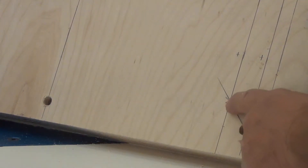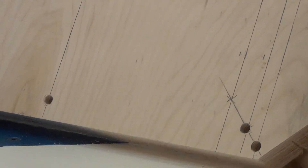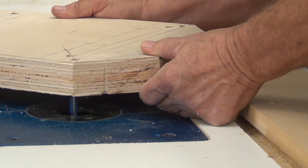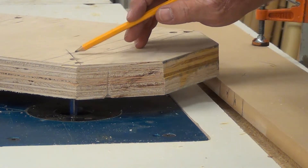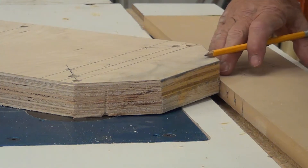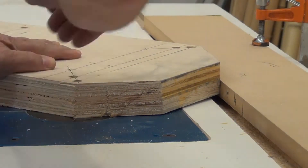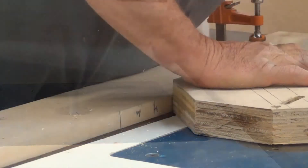I'm going to cut a slot for the bolt with the V-groove bearing to adjust up and down. The problem is my three-eighths router bit on the router table only goes through just barely three-quarters, so I'll have to do it in two blind passes. I set the piece in place, marked where the edge was, came over an inch and three-eighths — that's the length I need — and I'll pull it back to that line. I've got a fence to guide me to keep the slot straight. Then I flip it over and do the other side so it goes all the way through clean.